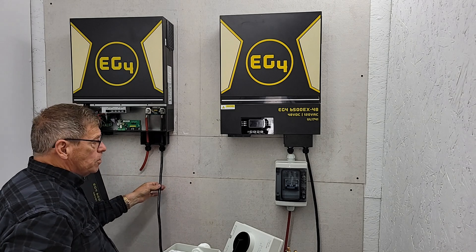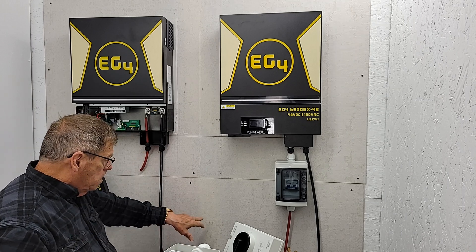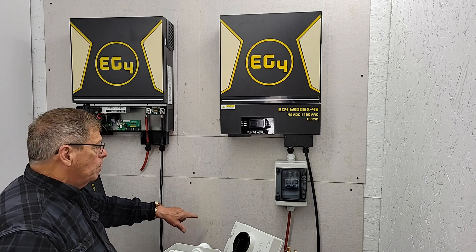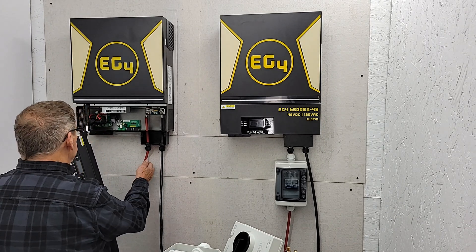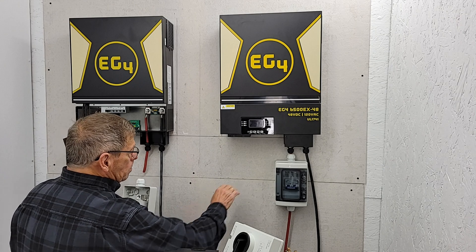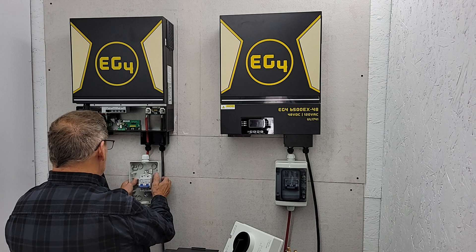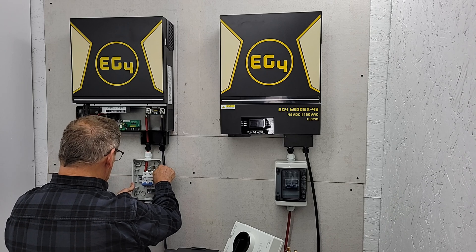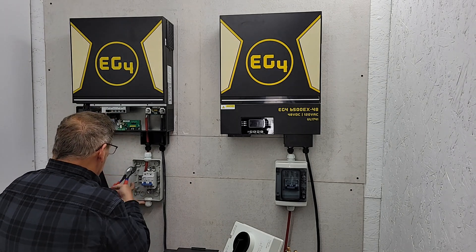This is number 2 wire welding cable, and I'm using that to get down to the junction terminals. Then from there to the batteries I'm going to go with four of them. The cables that came with it are much thicker. So I need to get this switch in here, and I want them to be at the same level. Right about there — right about there. That means I need to cut this right about there.